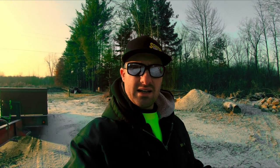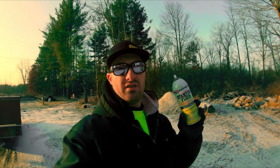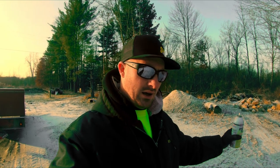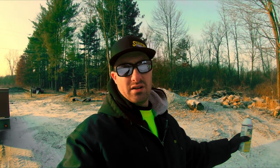So the first thing I wanted to discuss, there are a couple techniques that you can use when cold starting a diesel engine. And one of them that a lot of old timers jump to is this right here, starter fluid. Starter fluid is a way to start cold engines, but only if the engine is built for it. So let me specify. Back in the old days, you didn't really have glow plugs, you didn't really have grid heaters and all this other stuff.